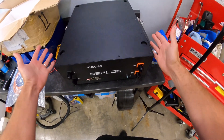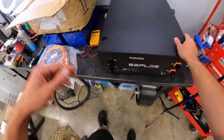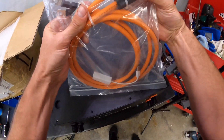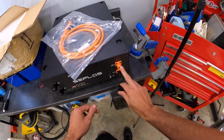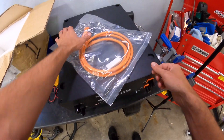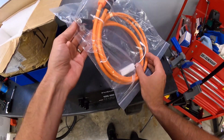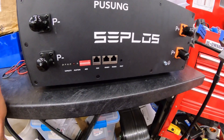When you get this, the main power supply cabinet comes just like this — there were just two set screws in the top which I took out, but that's pretty much all I've done. Here's what the battery cables look like — as you can see, these are pretty stout. When they connect into the server cabinet, you just pop off these protective caps and hook them on there. If you're linking to the next system up, it would have the same type of connector, so it just goes one to the other, and then that goes into the inverter.